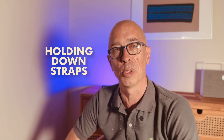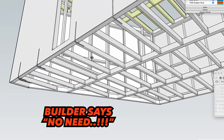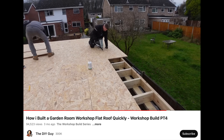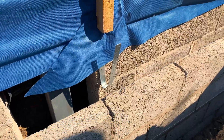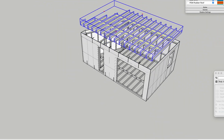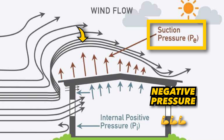Who needs holding down straps for your rafters and roof joists? 'The roof is heavy enough and there are all these nails and screws in it' — this chestnut is one I've given up arguing with builders about. If a builder can't show me photos of holding down straps and I didn't see them going in with my own eyes, it's time to pull off the plaster to see if they're really there — sometimes, sadly, they're not. The storm only comes along every 15 years, but how long are you intending to live in that house? When storm wind gets up, the pressure differentials can peel a two-tonne monopitch extension roof off like a rug on a lawn, shearing screws like brittle candy bars.